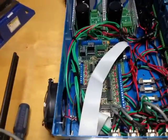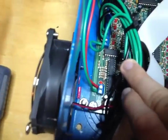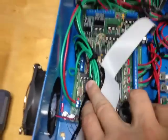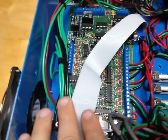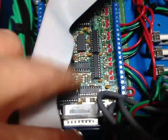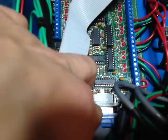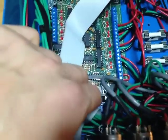Let's go ahead and talk about this board. First things first is the power input — those two connections there are the main 5 volt power coming from the 5 volt power supply, which powers most of the electronics. There's another 5 volt input we'll get to in a second that powers the actual output going to everything the board is controlling. Then we have the board output pass-through in case you need to plug this into something else.